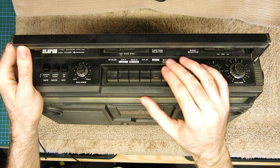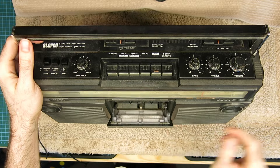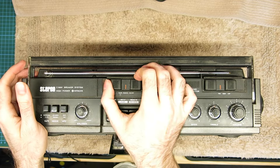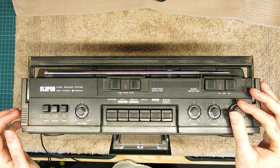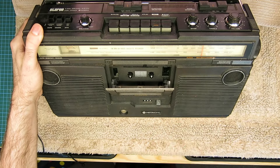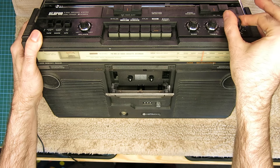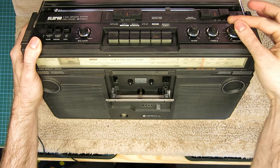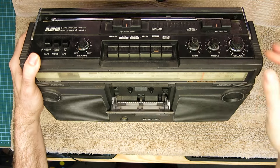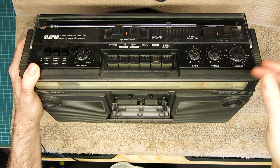The belts and mechanics on this are actually working — I'm not going to say they're working brilliantly, we've got a bit of a squeaky door — but it is operating, and these massive switches on the top are quite amusing. One of the faults is that only the right speaker seems to be working. If I turn the balance control to the left and turn up the volume it's there but very weak, and I'm not hearing any scratching around the pot, so it could be something as simple as a dirty contact in a switch or pot, but it might be something a little deeper.